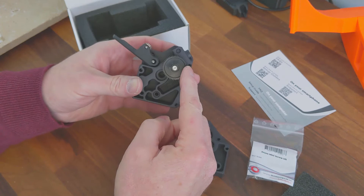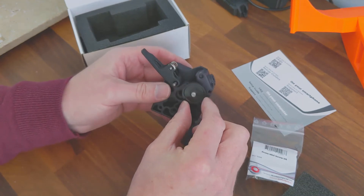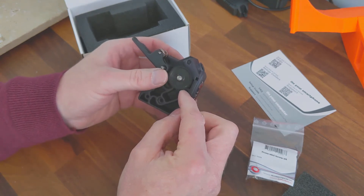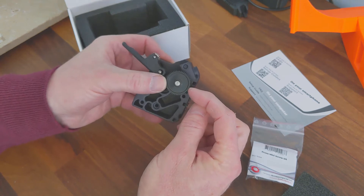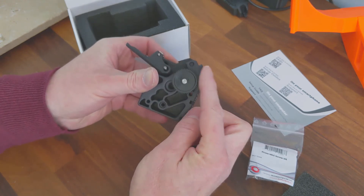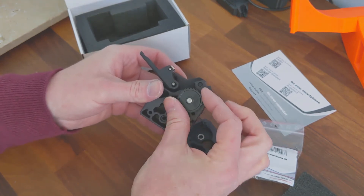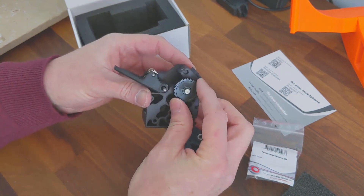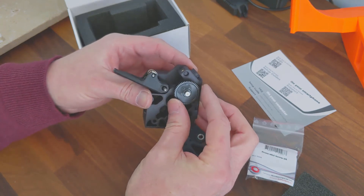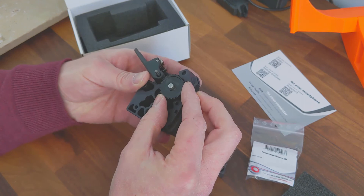This spur gear is one of the offending parts on the Prusa, because the Prusa spur gear is brass against the metal pinion. That's where we have the microscopic slot between the gears, and when it goes backwards and forwards on extrusion and retraction, that's where we get the slop and the ticking noise. So I guess having plastic does mean we shouldn't get that noise — plastic against metal — but I just wonder how long that gear is actually going to last. Hopefully it'll be good.